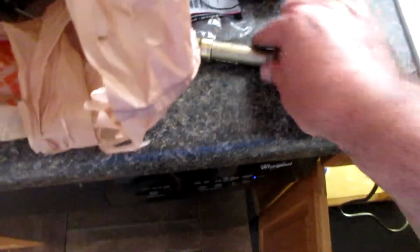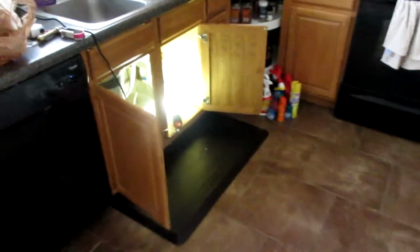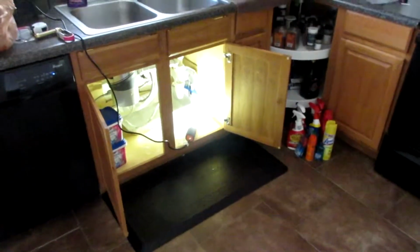Till next time. Oh yeah, I did want to mention this dude. It is the SharkBite tool, and it is fantastic. I just pulled 4 of them off and put them back on. Basically, it just fits. Something like that. And whenever you squeeze it, it pulls the SharkBite back out. You can pull the PEX out, copper or whatever. And you'll notice that these SharkBites, you can use with copper or the PEX. And they even had the braided lines. I was going to use those, but this ended up working out better. So that's my first job doing something like that.